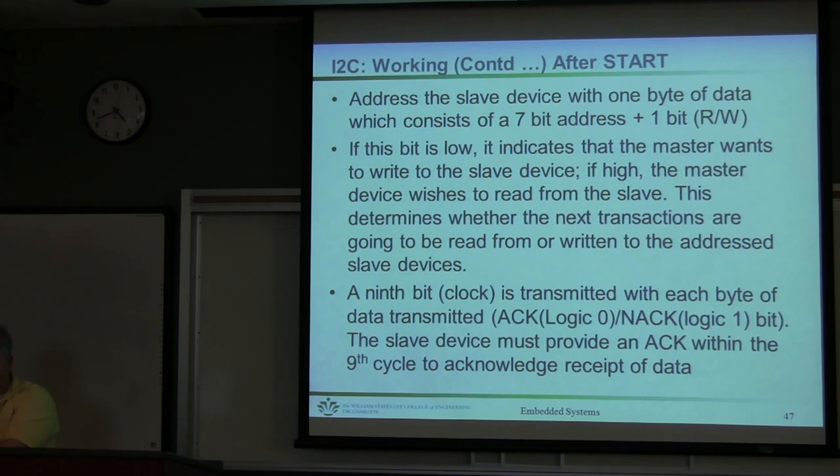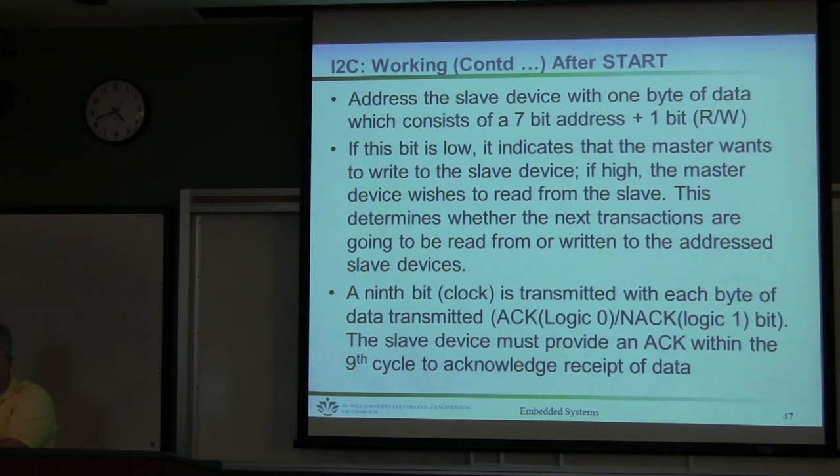It's a synchronous communication, so you're sending out to somebody based on an address. Be nice to know if the other device is actually listening, right? Because since it's address-based, you don't know if the other device is actually listening. Now keep in mind, this is a pretty low-level protocol. All it determines is who gets access to that. It doesn't say anything about the data.